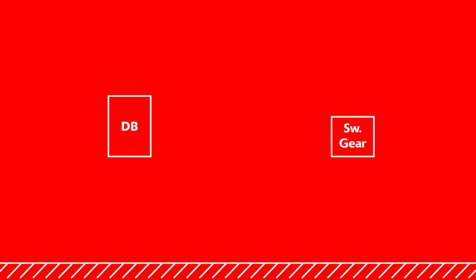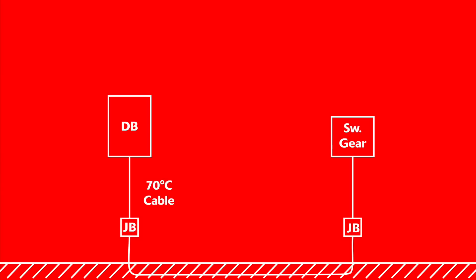That would mean you might be able to install a cable with a smaller cross-sectional area. So if you're running a cable from a distribution board to a piece of switchgear some distance away that requires a change in cable anyway, you could start the circuit with a cable based on the 70 degree ratings, then swap it to a potentially smaller cable based on the 90 degree rating table using connectors and enclosures rated at the higher temperature, then swap back again at the other end to a cable sized using the 70 degree rating. Depending on the length of run and other factors, this may end up being a cheaper option even when you factor in the additional labour required.